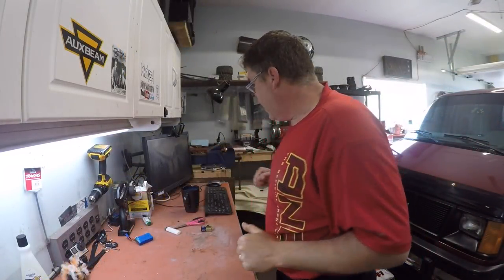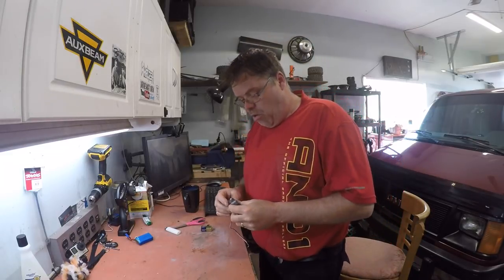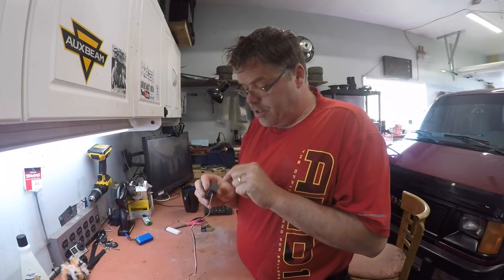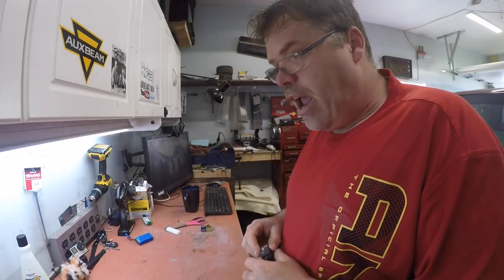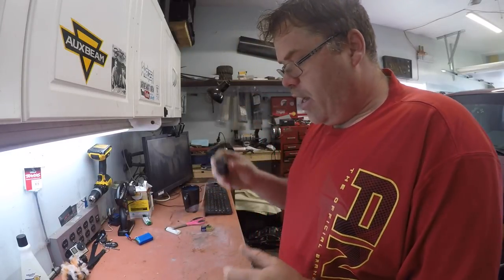Another thing I did too last night that I forgot to tell ya — it's good ol' Kevin there. He watched my video when I took out the servo on the old rock crawlo, eh? So this one is a Metal Gear, boys — it's a 2075X. Kevin threw me over a video on how to fix these. What it is is there's a little circuit board on this side of it inside that blows. So if you solder it and put a little wire in there, it works again. And it worked too, boys — she works again. I'll make sure I throw that link below for that how-to-fix-it thing. Thanks Kevin for sending that, and thanks Pat for finding it. Kevin's buddy Pat found the link. Make sure you go over there and check out Kevin's channel too — I'll put the link below. So now I got four links below. Works good. Appreciate it big time, cause now I don't have to buy another servo. And now there's an easy way to fix them.